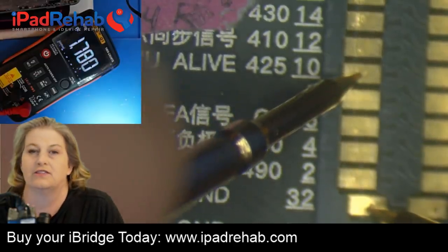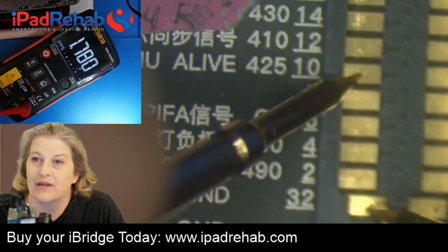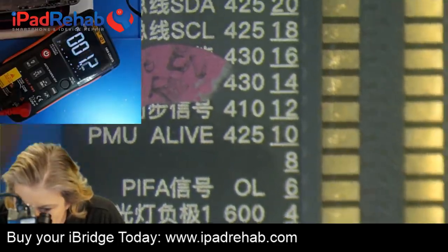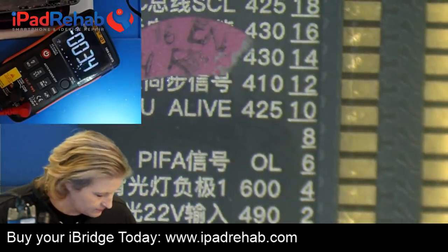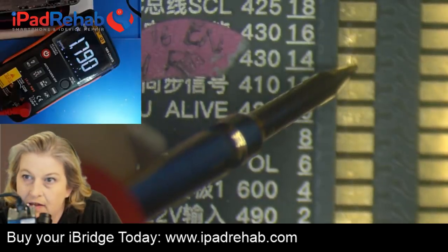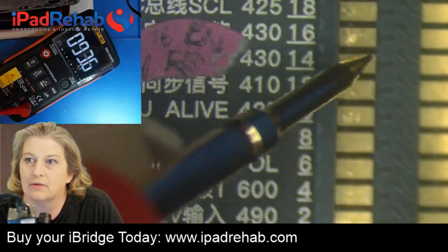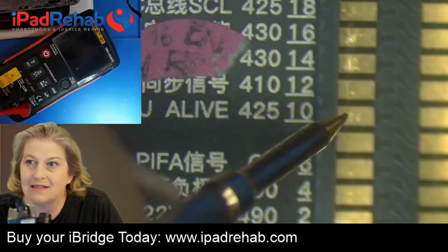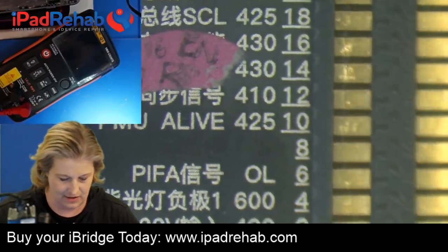How about PMU Alive? Did you know that PMU Alive comes from the PMIC, which it does, and it goes to the screen? I remember we figured this out a while ago, that the way the device detects that you've got a screen there is that PMU Alive actually goes through the screen and it turns into, wake up again, screen. Let's see, PMU Alive, 1.78. And here we go on pin number 14, reset. So 1.7, this actually goes from here through the screen and ends up showing up right here as the reset line. So without the screen connected, PMU Alive doesn't actually make it through the screen. It doesn't actually come out and go down the reset line.